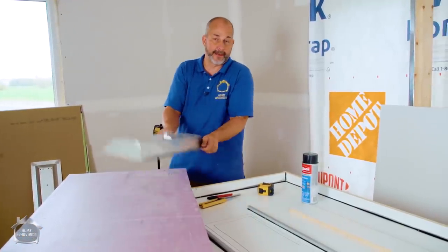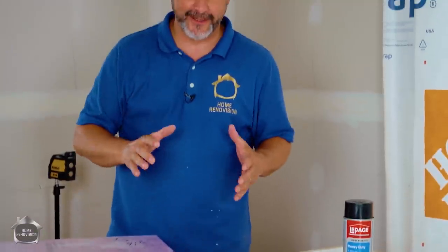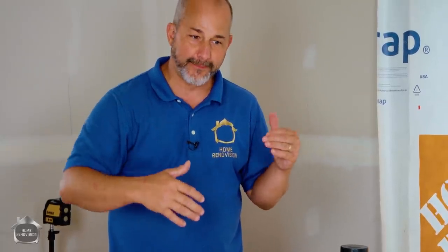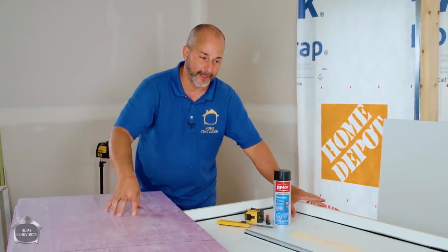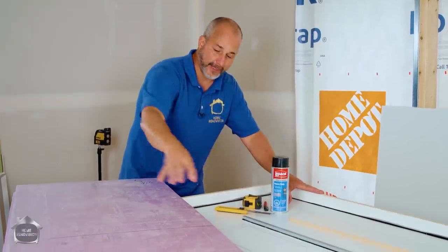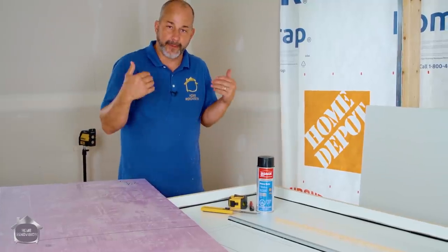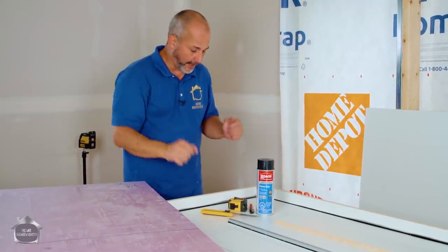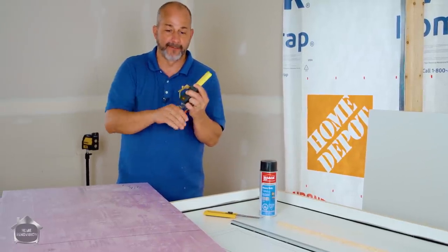We'll cut two of those and then we're just going to put them in place using a spray adhesive. So Max is over here just trying to wrap his mind around it. When you're doing things backwards, upside down, it can mess with your brain until you've actually seen it completed. But he was going, so how do you drill the rest of the hole later? And I'm like, no, this is 2 inches thick. This rise here is 2 inches thick. So now when I pour my concrete, I want to see the foam exposed. Then I know that when I pull it all apart, the hole is already fully engaged and everything should be fine. And if that helped anybody, then it was worth saying.